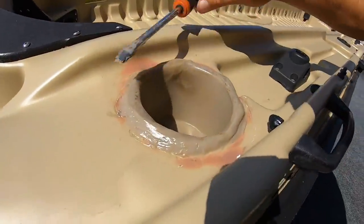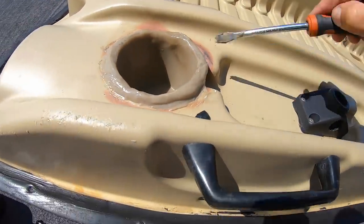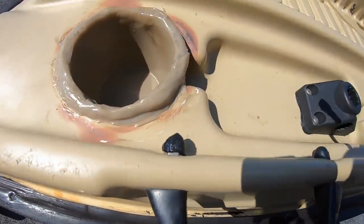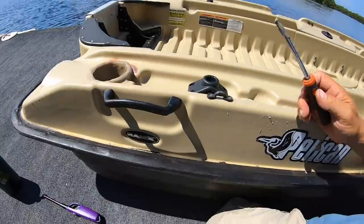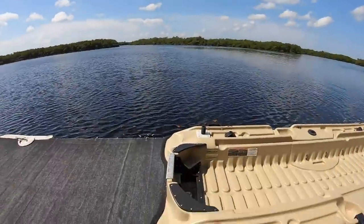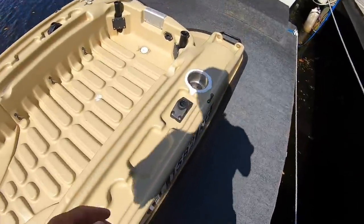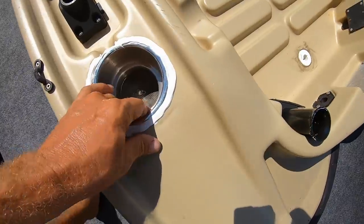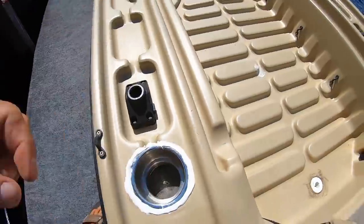Okay, it's still kind of mushy. The plastic of the boat discolored a little bit, but once that cools there's going to be a bond between the two plastics since they're the same — no water will be able to get in there anymore. That should never leak again. It's not really any uglier than this; the difference is that one is not going to come apart.